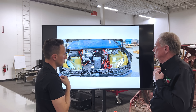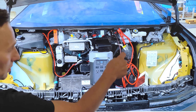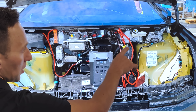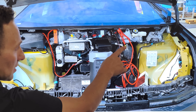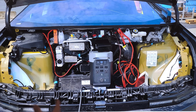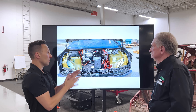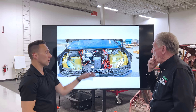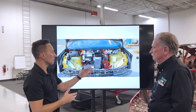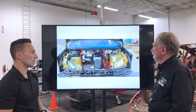We're seeing them isolate everything to the casting. Looking at the EAC compressor — that cylindrical piece — if you look right at the top it looks like a cast aluminum neck coming up, which follows the split line of the compressor, so presumably that's now cast in. On previous iterations the mount that interfaced directly with the super beam or casting was a separate piece. When we talk to OEM clients, we always say if you can make the part provide its own mounting feature, that's the way to go versus a separate bracket.